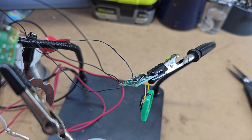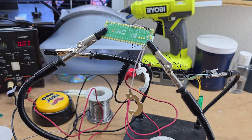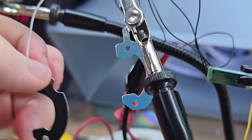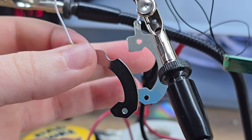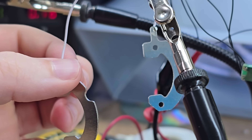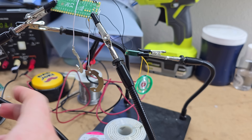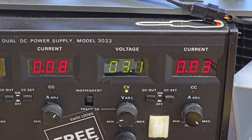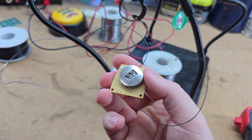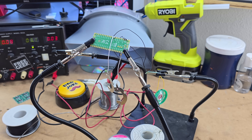For now this will do. I have the audio amplifier hooked up to the speaker and everything is connected. We'll flip it on - oh, you hear that? Check this out, we're going to make contact. It works perfect! Okay actually it's not supposed to keep going - not supposed to be doing that. Well, that was weird, I'll fix that. I'm running this off of the power supply right now, you can see three volts. However, when I hook it up to the CR2032 battery, the voltage on this just drops instantly to like 1.3 volts, which is not going to be enough to run this. So unfortunately, I'm going to have to find another battery option.